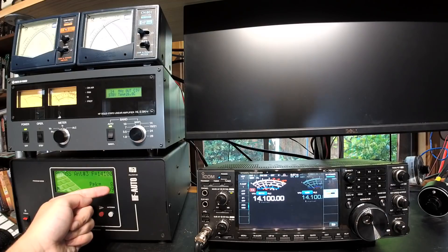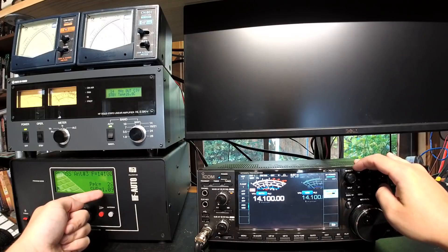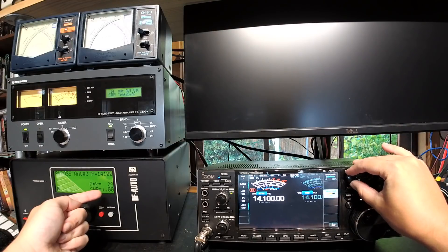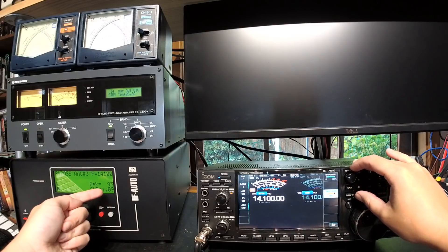We're making a peak power of 8 watts. If I use the multi-knob to adjust the drive gain up — when this fault first occurred, going to 64% would actually take it to 100 watts; it's now only taking it to 28. If I crank the drive knob up to about 80, we get 75 watts out. If I go up to 90, we get about 94 watts.